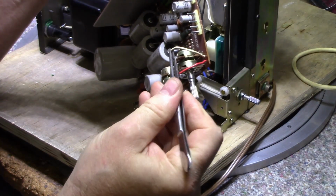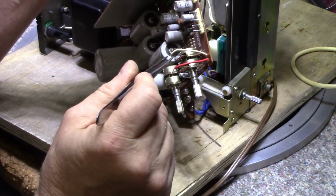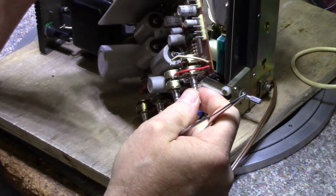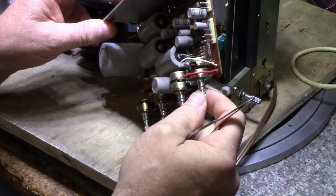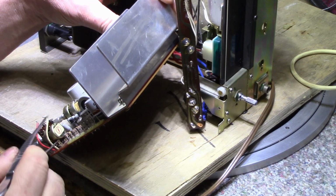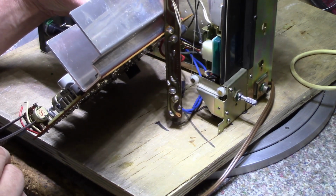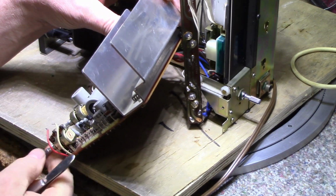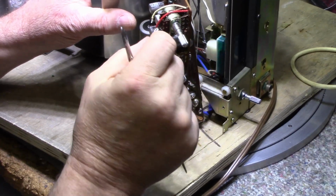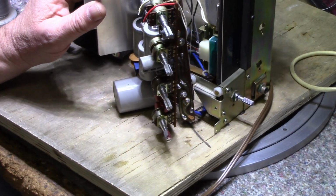And we have two wires here that go up, and they've obviously been removed from something because they're tinned on the ends here. So I think somebody replaced this pot, even though it has the same markings on the back and everything. You can see the markings on the back. It's got that the same. Looks like somebody went in here and replaced the volume pot a long time ago, and they didn't hook it up right, or they didn't finish the job. Anyways, I'm just poking around here.